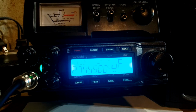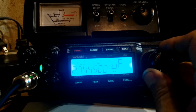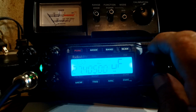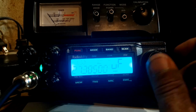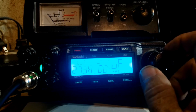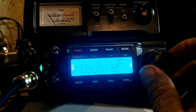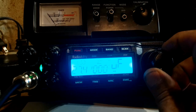You see that little arrow under the right hand number 5? Well, that little arrow stays right there. When you turn the channel normal, see it changes. We're on 44, 43, we'll go down. Channel 38. But now if we press this button, it changes that digit. So we can split the channels. We're on 3900 now. And when it stops blinking, it's back to doing the regular channels.